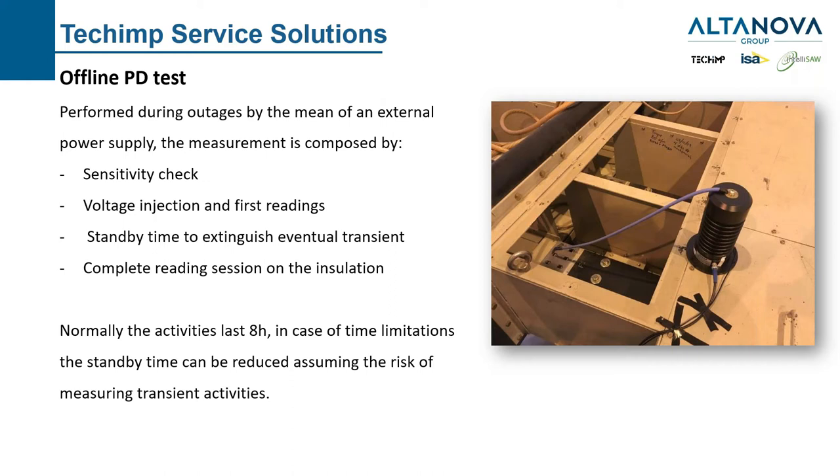In cases of time limitation, we have also had to perform this test in a very short time interval, but in this case we are affected by some of the transients at the beginning of the voltage injection. My personal opinion is that sometimes an offline test costs more than a sensor installation and an online test — and it's just a once-in-a-lifetime offline test. I always prefer to have a permanently installed sensor. Our acquisition unit has no problem with two nanofarad, one nanofarad, or 80 picofarad capacitive couplers, and we can take measurements from all different sensors for comparison.